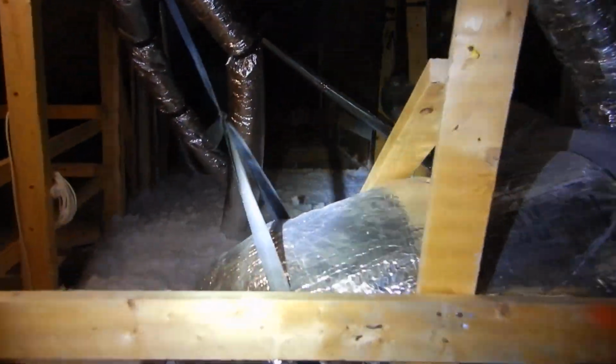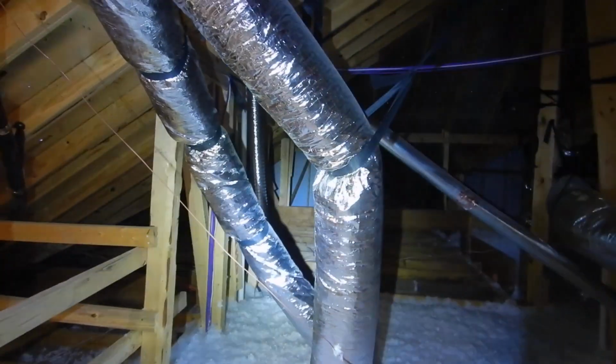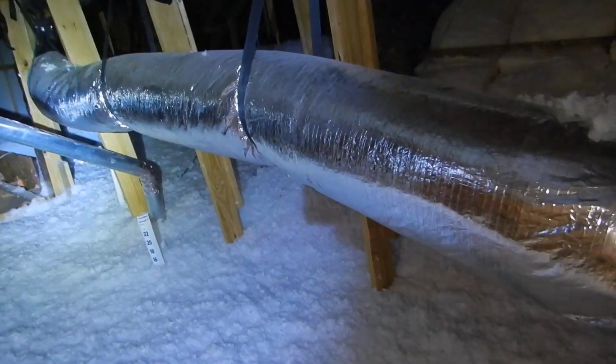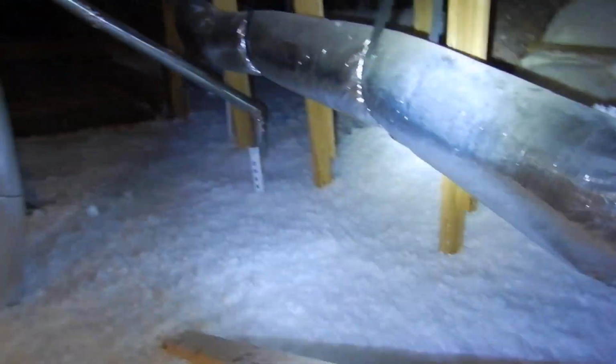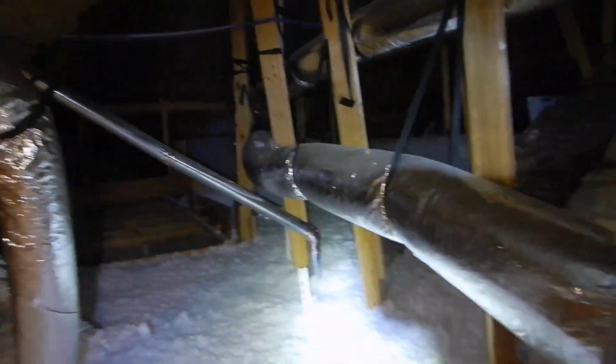But one thing I can say is these belts, this nylon webbing, it curls. See that? It curls just like the elastic in a cheap pair of underwear. And when it curls, it'll continue to curl, and it cuts into the webbing, cuts into the air duct, causing restrictions. There should be saddles underneath those loops. A lot of times they use cardboard. Some of them use sheet metal, so that's better. But even cardboard, after time, these belts are going to start curling on you and kinking on your insulation and making you uncomfortable.